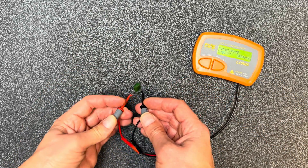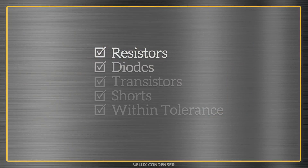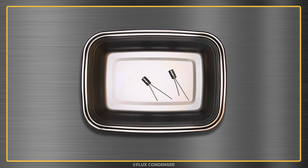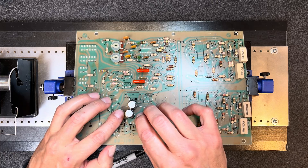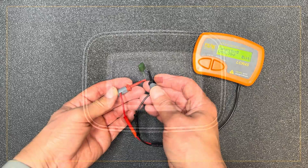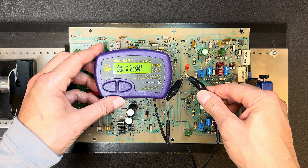The most time-consuming testing was for all the electronic components. Capacitors were tested for capacitance, ESR, and parallel leakage. Resistors, diodes, and transistors were all tested for shorts and to make sure they were within tolerance. All components tested perfectly except for three electrolytic capacitors which failed the leakage test and two which had unacceptably high ESR. For reliability's sake I ended up replacing all the electrolytic capacitors with new ones regardless. And believe it or not, one brand new quality capacitor tested as faulty — so test all components before installing them, whether new or old.